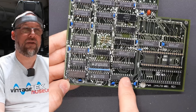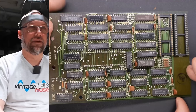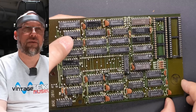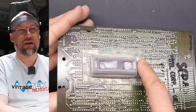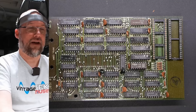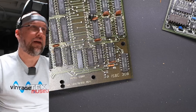Moving on, we have another board here that has a 40-pin DIP that would have plugged into a board — the pins are all bent up unfortunately. It does say scrap on it. There's space for — presumably you take the processor out and put another one on here, maybe giving you a math coprocessor or something like that. PWA-144-179-001, Intel Corp, 1981, 48th week. We've got SRAM here and SRAM here.